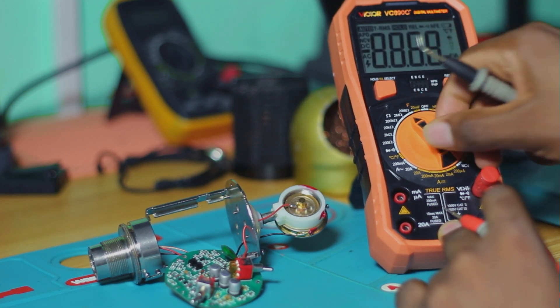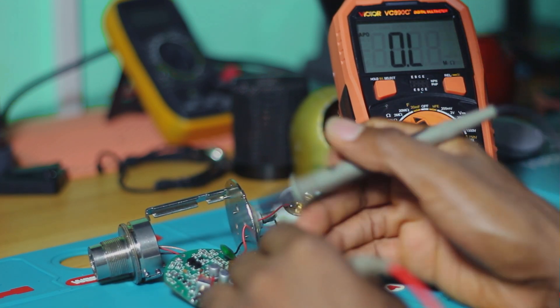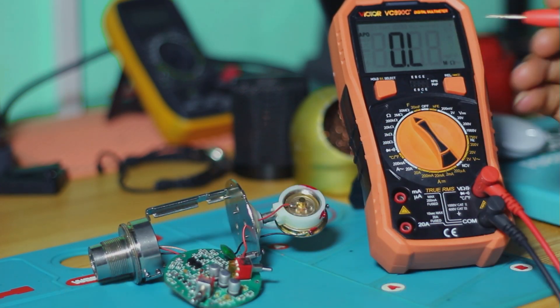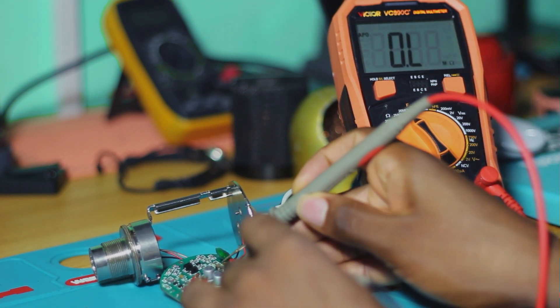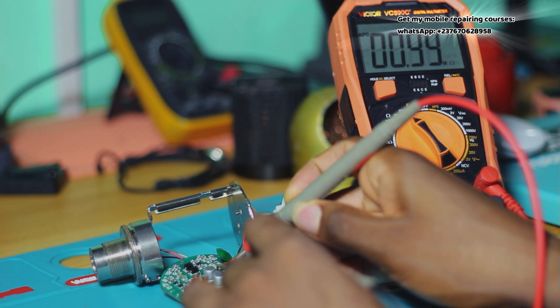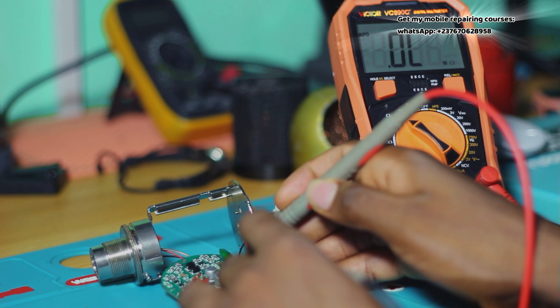Take time to look at your multimeter, set the correct range, and take a deep look at a mobile PCB or any electronic PCB — you can find the faulty component. If not for that knowledge, I wouldn't have suspected that resistor. There were other resistors in the PCB that weren't reading, but I know that high-value resistors need to be tested in a specific range. Yesterday I changed the range, kept testing resistors, found the one not reading on any range, and that was it — fixed.